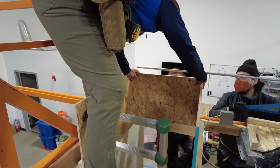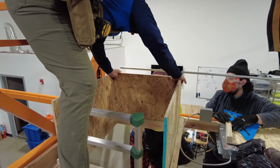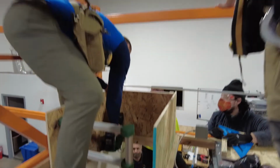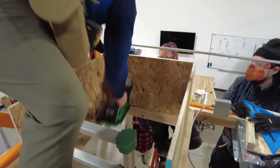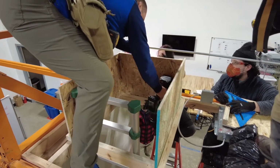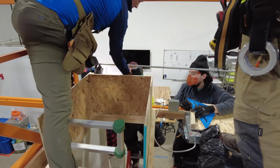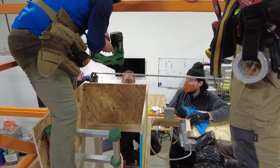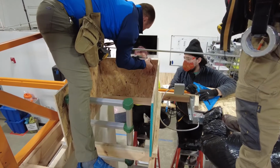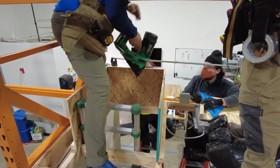I don't need that yet, because what am I referencing? The bottom? I'm making my bottom flush. I can only control one nail at a time, so I can only flush up one thing at a time, okay? I'm using my gun to kind of help. Put one nail. Flush it up. One nail. And I never want my hand on the inside when I actually nail, because the first time you do, it's the first time you're gonna get hurt. And that's the way it works.